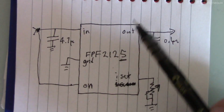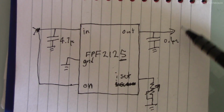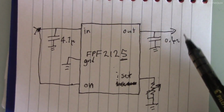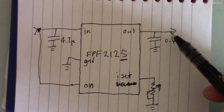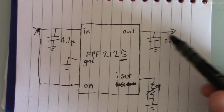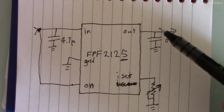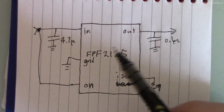Now the 2123, once the output current limit is exceeded, it shuts the output off, and then 10 milliseconds later it turns it back on again. So it has this self-reset behavior. Now that might work, but it's up to the device you're charging. Some devices, like I have a power bank, that absolutely would work fine with that. If it quickly sees the output or the input go away and then come back, it says, oh, I pulled too much current and I caused it to overcurrent, so I'll back off. In which case the 2123 will work just fine. Other devices may not figure that out, and they may just keep retrying the same current over and over and over again and not get anywhere. So the 2123 might work, might not. I haven't tried it yet.